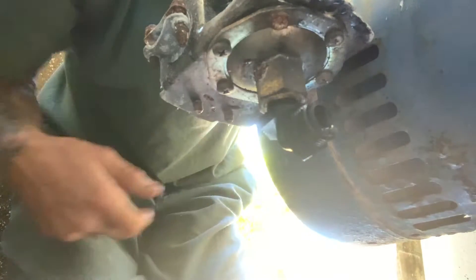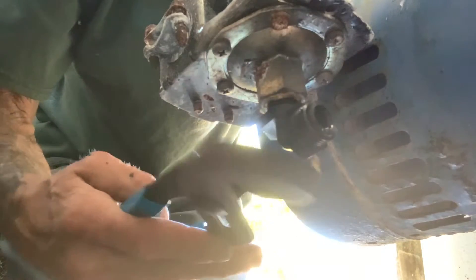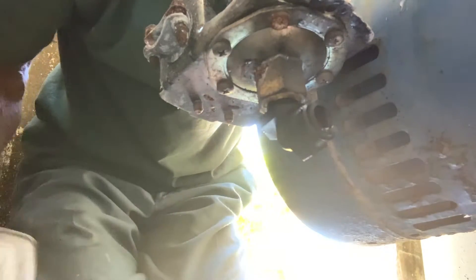This little plastic piece has to come out of here — just be gentle because it's plastic on metal. Use a pair of channel locks and back it out, then save it. I didn't know this was an artesian well, so when I took the pressure line off the switch it just kept flowing and flowing. I had to put it back on, go around to the other side of the well house, and cut the valve off. Now that the water's off, the switch is ready to come out.